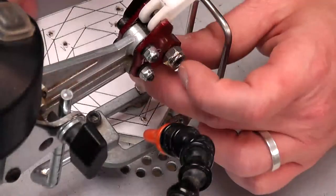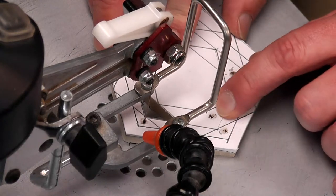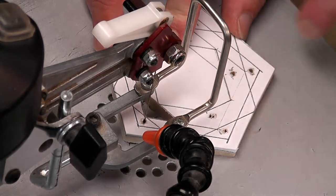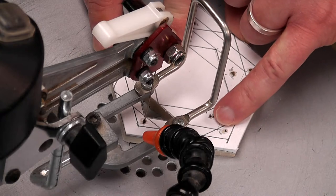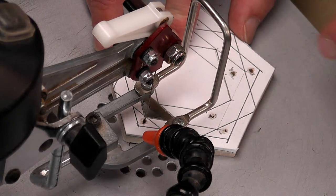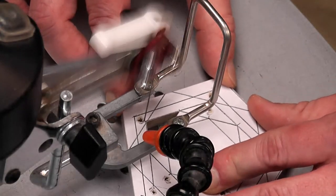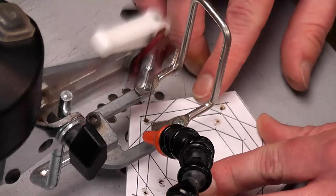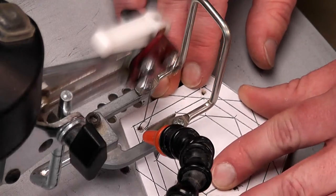We're just going to go through the motions and cut these little triangles out. These two triangles are connected by a little bit here — in theory you could cut right through there, but as I've been doing a few of these I found that as we exited through here into the void we were going to cut, we get a little bit of breakout. So I've gone back to cutting them each individually. We're going to pick up on that straight line, reverse back up into our drill hole, and then come on the other line — it's going to come up and meet it in that corner.